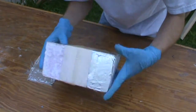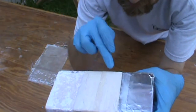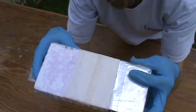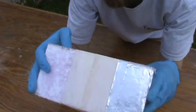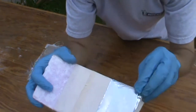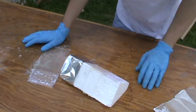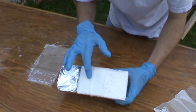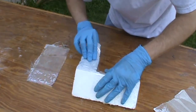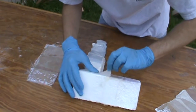Something interesting I noticed with the PVA even before we put resin down is that the masking tape started doing something strange — you can see the lines there where it started wrinkling up, almost like the PVA had some sort of negative reaction to the adhesive. It's just not quite as smooth as it was before. Going ahead and peeling this side off — you can see where the masking tape had caved a little bit on the side without PVA.